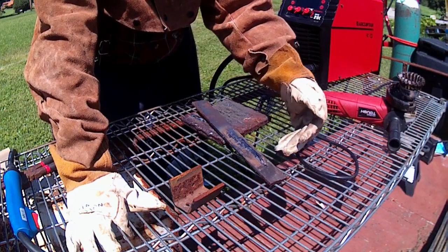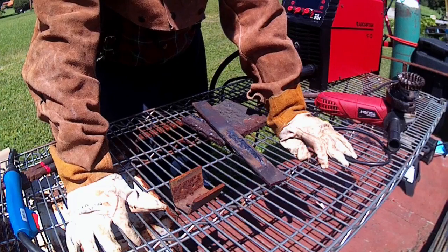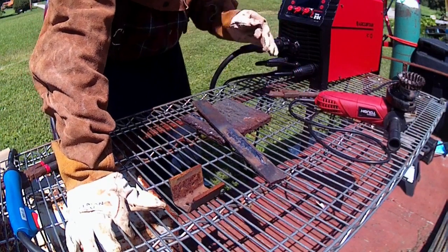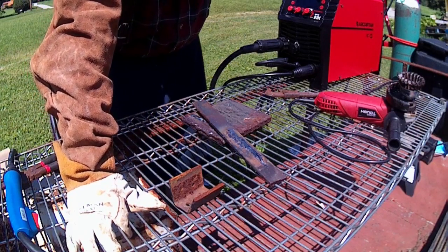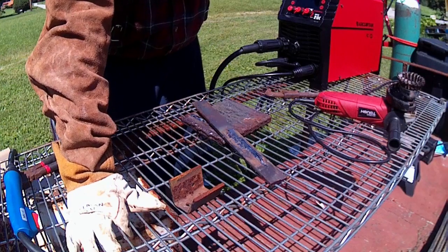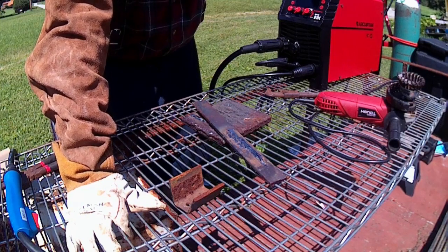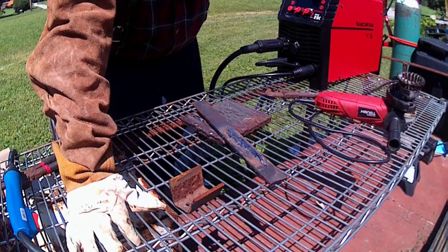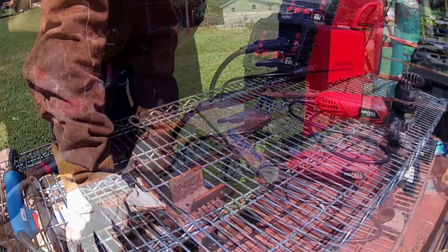Right at the end of this weld here, I got drug up on some spatter in the nozzle, but like I said, it wasn't bad. It's different getting used to it. And to be frank with you, if they're giving you the charts now, I wouldn't even bother with the synergic setting, because it has limits on your volts up and down by like 3 volts plus or minus. And then if you get that and then you just want to bump up your amps, it's gonna raise up your volts anyway. So yeah, you can get some okay beads with the synergic setting, but really I'd just go with manual MIG mode. Follow your chart here, or look up one on the camera there.